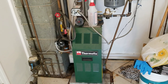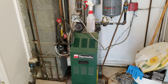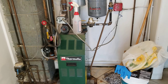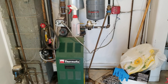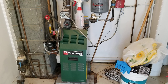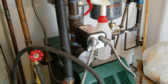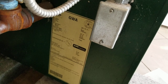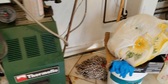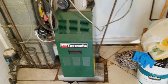This is a house I just bought — just to show you how I clean the flame sensor. The reason I do that is because it keeps turning off — the flame keeps coming on and off. After I clean it, everything worked perfect. When you need a part, on the left-hand side there's a model number or serial number and you can order it — make sure that you match it with the other number.